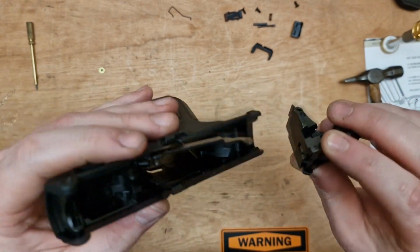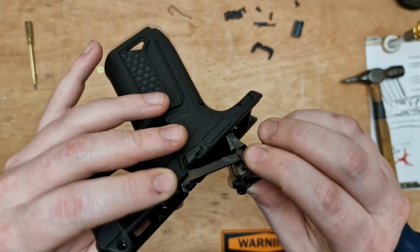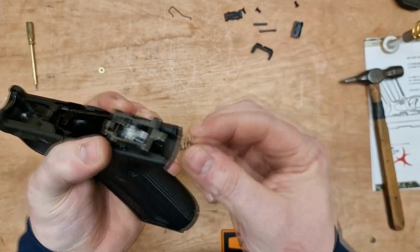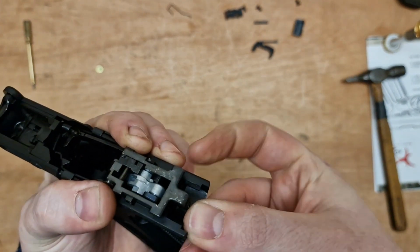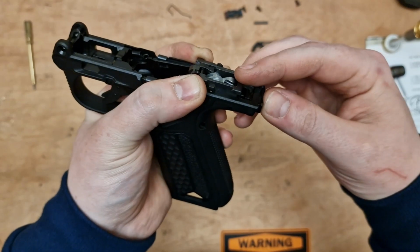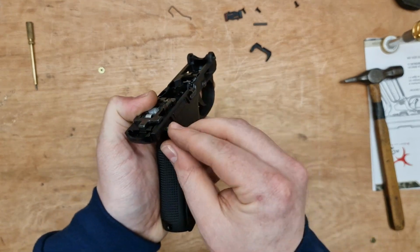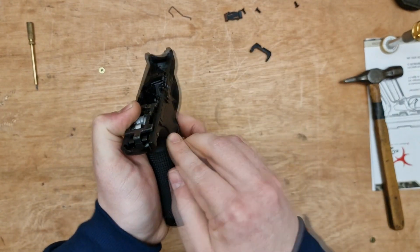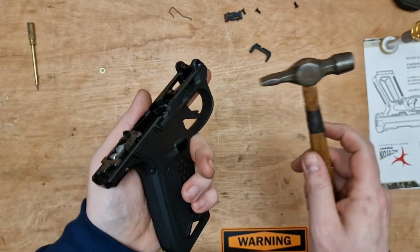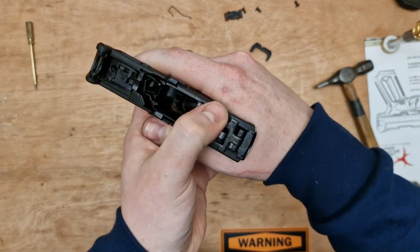And then you can take the hammer housing and we can line that trigger bar up with the hammer housing like that, which is far easier. And then we line that up with the body, goes into place like that. We pop the spring on the back of the housing there like that. We take the button, that goes in next. As we push the button in, we push the hammer assembly down, and that's all locked into place. We want to pop that pin in and that pin. Like so. Make sure the trigger pin's in as well. Just give a function check. Yep, everything works.